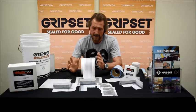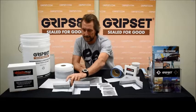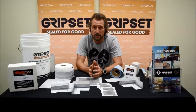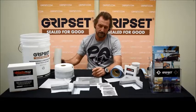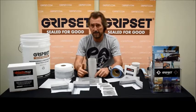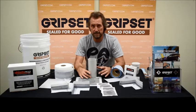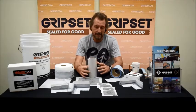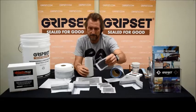The other part of the Elastoproof range is our collars. Over the years, when you look at where problems lie in the industry, they are either at a joint, a junction, or at a penetration — and penetrations are still a problem. When you've got a pipe coming out of the ground, a wall, or a floor, what you sometimes see is they're just bogged up with sealant. That may seal the job, but sealants are not rupture-resistant — if the pipe moves for any reason, that seal can break.